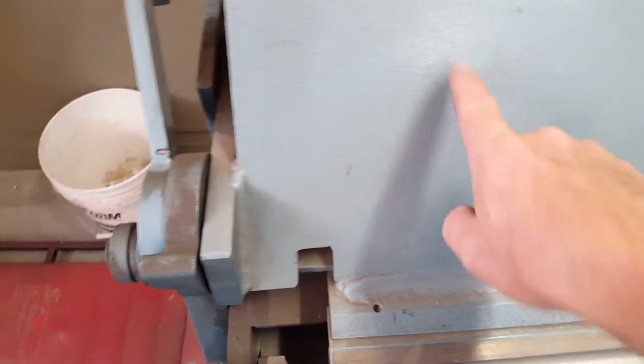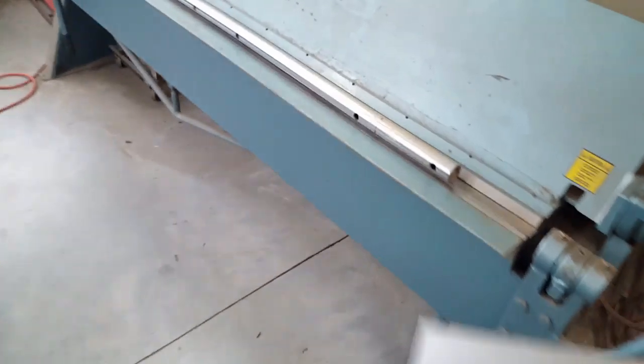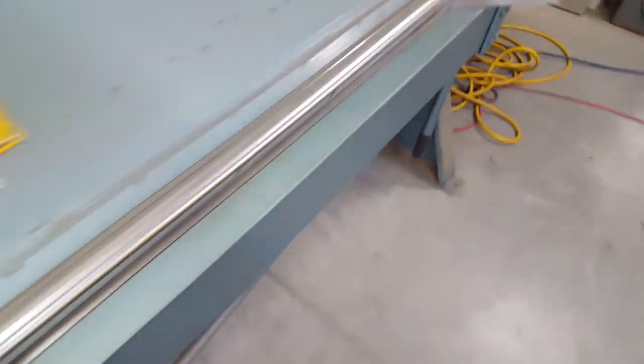The thing you have to do is move this jaw back in that direction to its maximum. Then you have to adjust the clamps on the ends here, which is this adjustment right here. Loosen this nut up so that it'll accommodate both the flange that you've welded to that piece of pipe, and the stock that you need to put the roll in, so that when it tightens down, you don't overtighten these ends of the sheet metal brake. So these are set right now to clamp everything up nicely.